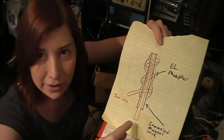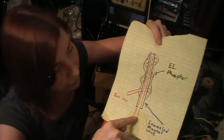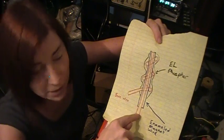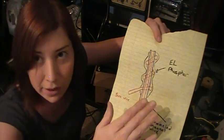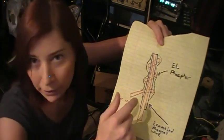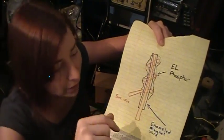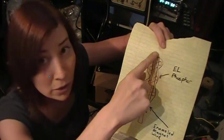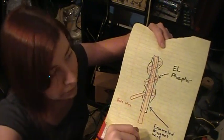You're going to make a structure like this. You're going to have your enameled magnet wire running up the center of your EL wire. You're going to strip back some of the enamel — scrape it off so you can get to the copper conductor on the inside — but leave most of it insulated. Then take your bare wire and tightly wind it around the enameled wire, making sure you don't short it to the center conductor.